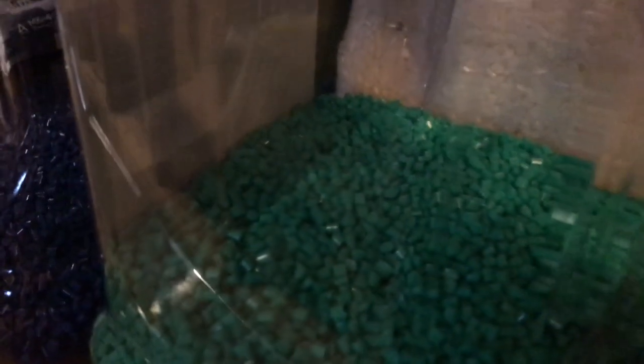The extruder will turn the pellets back into usable filament. One downside is that recycled filament is not as strong as manufactured filament because it's already been used once. One way to make this work is to incorporate more virgin plastic material — like 75% recycled and 25% new plastic pellets. If you're going for desktop figurine-type prints it shouldn't be an issue; it's only a concern for prints that will have force applied or need structural integrity.